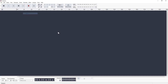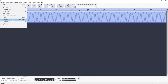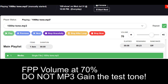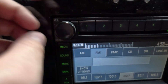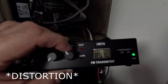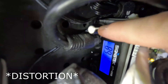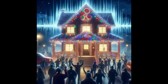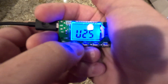We are going to use a 0 dB 100 Hz test tone. This audio file is at the maximum volume level without distortion, and any distortion downstream is easy to hear with bass. Generate one in Audacity or download it from the link. Play the 100 Hz test tone from FPP or your computer on a loop. Get your listening device — such as a car radio if broadcasting, or external speakers — at around 25% volume. With the test tone playing, slowly turn up the gain on your FM transmitter until you hear distortion, then back it down until distortion is gone. Now leave it set there — done. You've optimized your audio gain. If you're using the FM board, you can skip optimization as inputs are set digitally — leave it at 26.